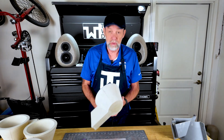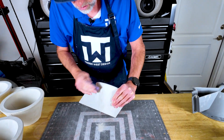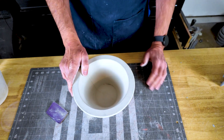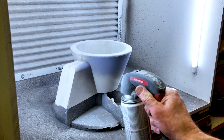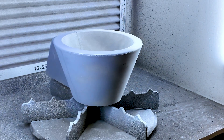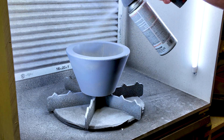Our next step is getting these ready for primer. We have a parting line where the molds meet — we need to take sandpaper and feel for any rough spots that need to be sanded smooth. This is just 150 grit, or you can use 80 grit. Once we sand all of them smooth, we'll send them to the paint booth and get some primer on. We do a semi-light first layer to get everything covered, then come back for a second heavier coat. I usually do a couple of heavy coats to really load it on, then let it dry.